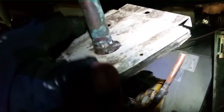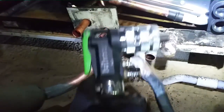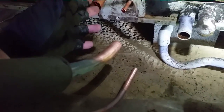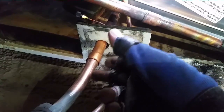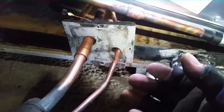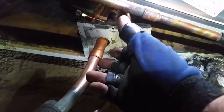Dear previous installer — your brazing is so poor that we can't even get the panel off because of the turds on the bottom of the joint. Thank you, previous installer. Since I have a three-quarter line coming in and a seven-eighths line over here, I'll take my three-quarter swage, put it in the line and flare it out enough for a tighter fit going into that seven-eighths bell. I flared it all the way out as far as it would go — still a bit loose — so I expanded the seven-eighths copper further. Larger residential copper can expand more than three-eighths, which sometimes tears. If there's a small tear I'll fill it with solder, but we got it close enough for a good fit.